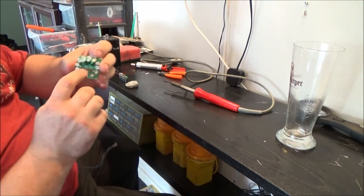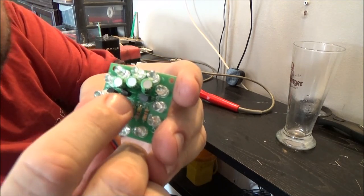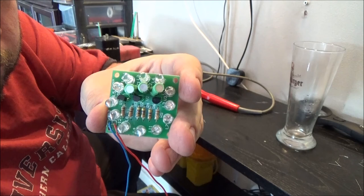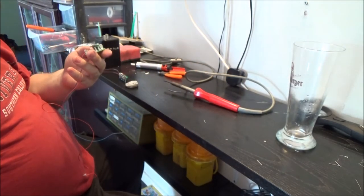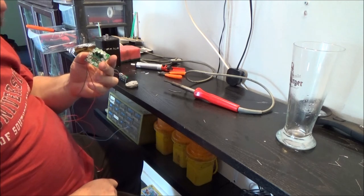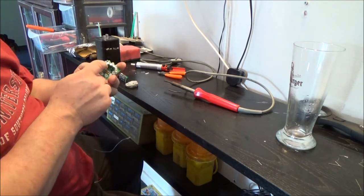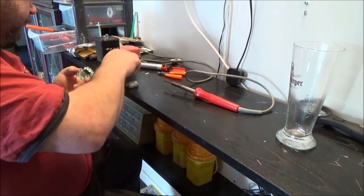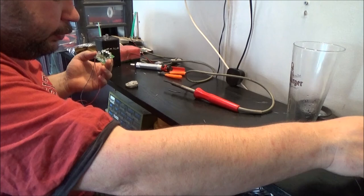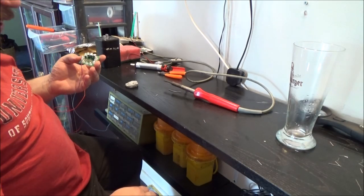Well, that proves I was right, because if you look, there's two transistors here that sit really close to each other, then there's that one that sort of sits on its own. So I just applied a bit of logic, basically, and thought, well, it's likely that the two with the same numbers will go side by side. And the fact it works proves that my logic was right.